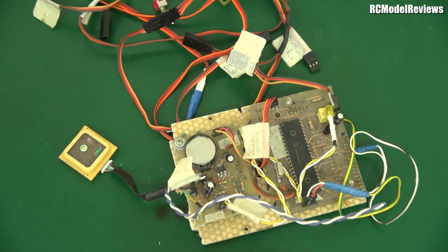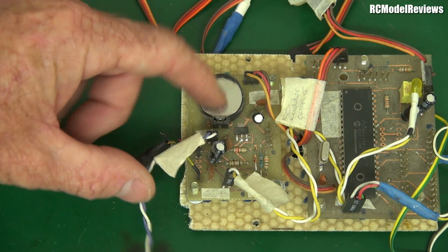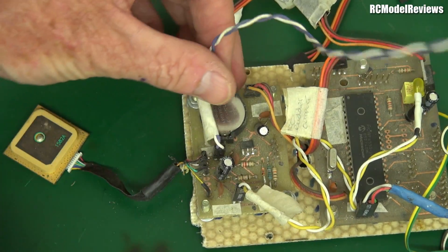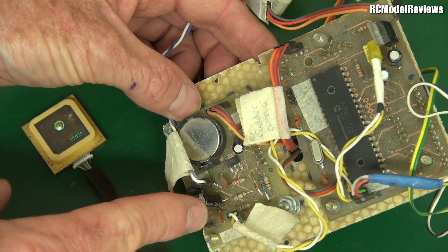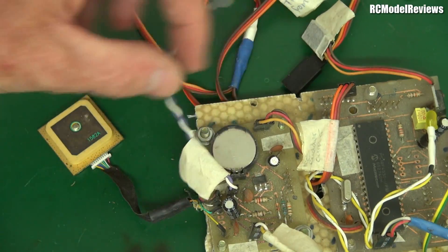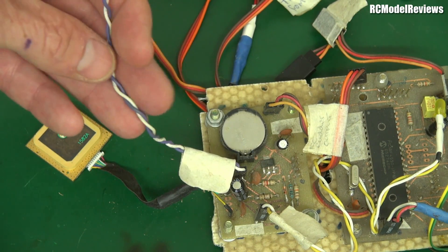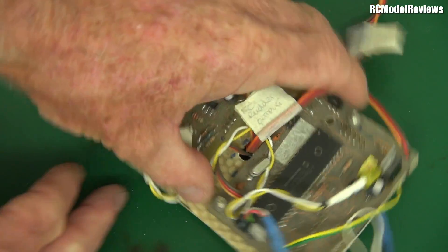This GPS connected to this little interface board. It obviously has a backup battery and an interface — I think there were TTL levels involved. Down here there's a little 3-volt regulator, capacitors, and resistors. This part was a power supply for the GPS with a battery backup, so if there was a spike or noise, the battery would take over and keep GPS coordinates flowing.